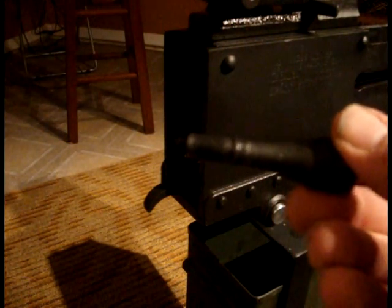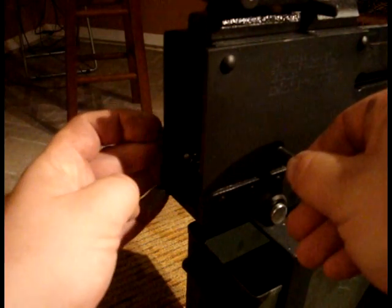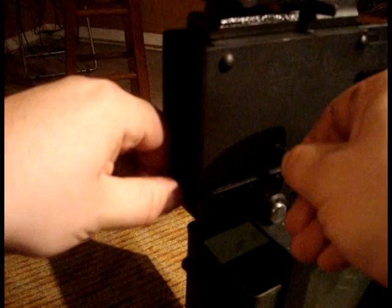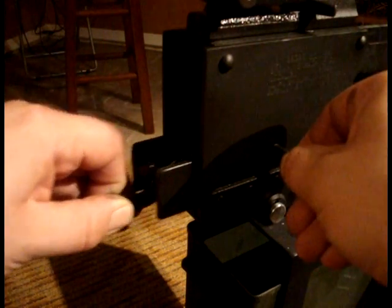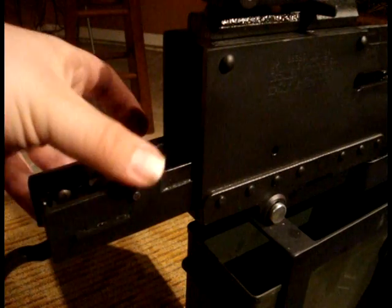Use the tip of the bolt handle that you just removed and press in on the hole on the right side of the receiver. This will release the trigger pin and allow you to slide the lock frame, the barrel, and barrel extension from the rear of the receiver.